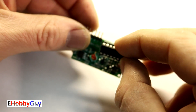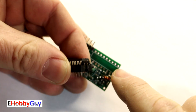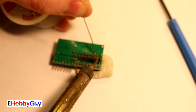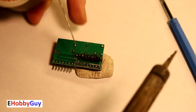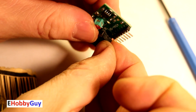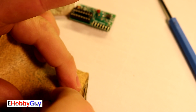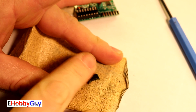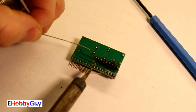Here it is with the chip removed. Next I soldered the standoff onto the board, making sure the notches on the chip socket aligned with the marking on the board. I soldered on the 16-pin socket, then sanded down the plastic on the extra two-pin cutaway piece to make it thin enough to fit into the slot for the last two pins. After soldering it in place I cleaned the board with rubbing alcohol.